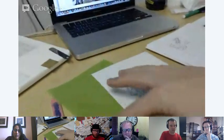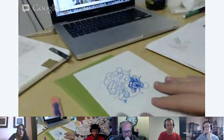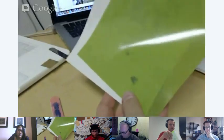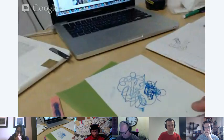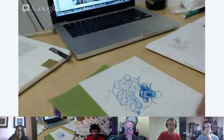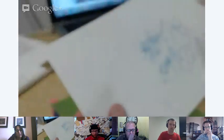So this is kind of like for more extreme smoothing issues where you want to work a little bit more aggressive on the way to the white, okay? And then an important point about this Mylar paper, I'm sorry, lapping film, is that you'll notice there's a side that's shiny, and you'll see that there's a side that's not shiny. You want to use the non-shiny side. This stuff is so non-abrasive. It's such a mild abrasive that sometimes you can't even tell the difference by feeling whether or not you're actually working on the abrasive side. You know, it's that mild. So if you want, take the shiny side and put a big Sharpie X on it so that you know not to smooth with that side of the paper.